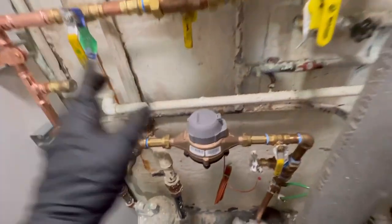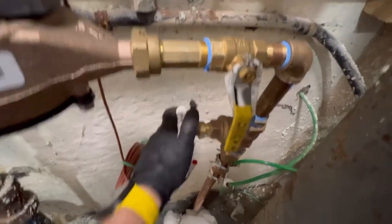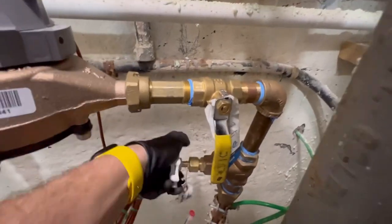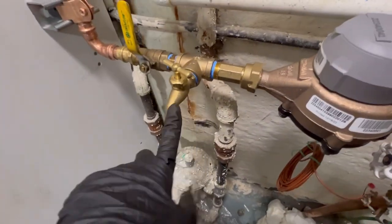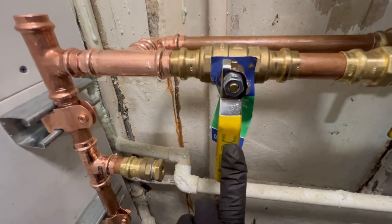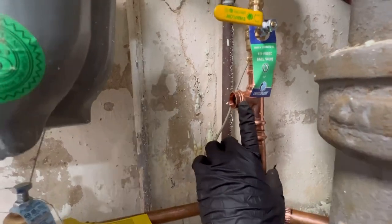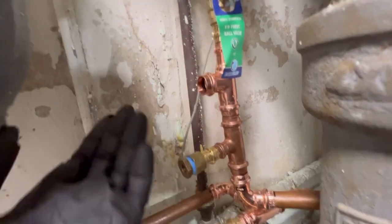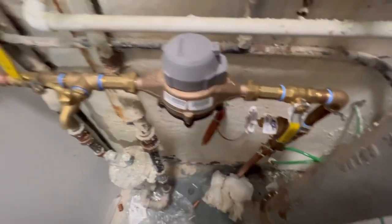The old meter is out. These old setters are prohibited anymore. We've got a new three-quarter Badger meter here — New York City redundancy. Test tee, non-threaded hose bib, outlet valve, gauge, bypass, pressure reducing valve — Webstone isolation valve with purge, three-quarter bypass in the back, and this will be our outlet pressure gauge. The SC-12 expansion tank by Amtrol is being mounted right here. This is the new setup — we just have to do the remote wiring and test for leaks.